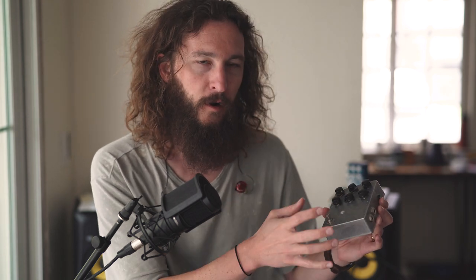By top down camera, I mean we're just going to have this little pedal board over here, which I think is out of frame right now. But if you are completely cold coming into this, this is a modulation pedal. It is a kind of chorus vibrato thing, but with some added weirdness. You have an analog style Bucket Brigade vibrato chorus in here that is being modulated by this low pass gate and an internal microprocessor that creates kind of a semi-random waveform.